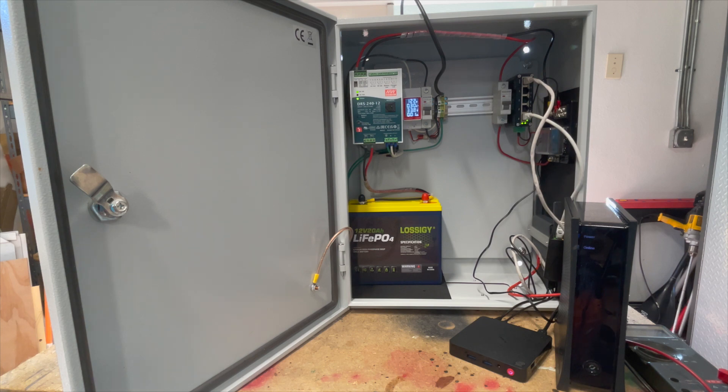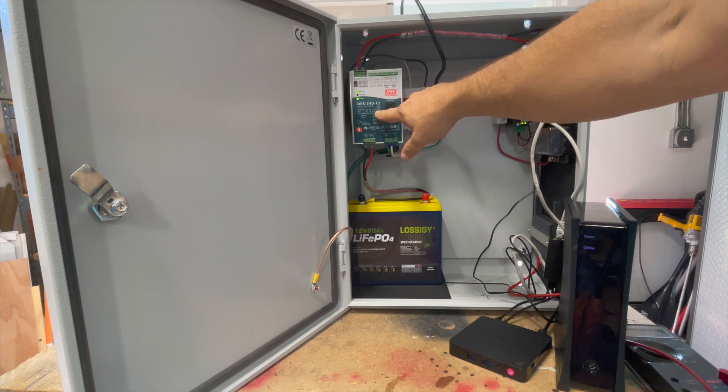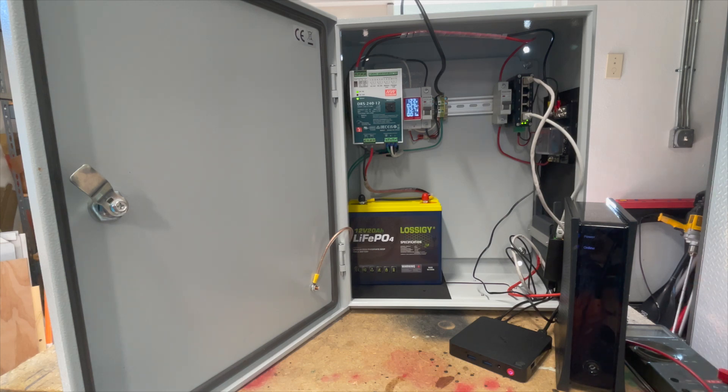What makes this really cool is that for remote or outpost-style systems, loss of power is a concern — whether from general utility supply issues or scenarios where you only have power part of the day, like a construction site or circuits tied to lot lighting. This power supply can deliver up to a maximum 20-amp 12-volt output on AC power, or it can draw from a connected battery if you lose power. There's really no dropout or sag in the DC voltage when you lose AC, so it handles power blips and brownouts as well.